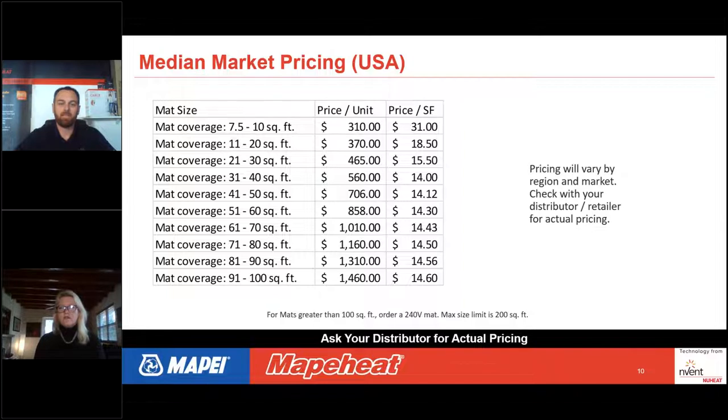Right, yes, thanks, Sonia. Hello, everybody. What Sonia has posted here on the page, starting at 7.5 square feet, is going to be the 120 volt listing. As you run up to 100 square feet, that's going to be for one piece of actual matting that's going to have one lead wire running off of a corner back to where you would terminate to a thermostat location. If you were to order that mat at 240 volt, the smallest 240 volt mat that would be available would be 15 square feet, going all the way up to 200 square feet in one piece of a custom mat. You can have multiple custom mats in a space, all hooked back up to one thermostat, and the limiting factor there is going to be 15 amps of draw per thermostat per voltage.